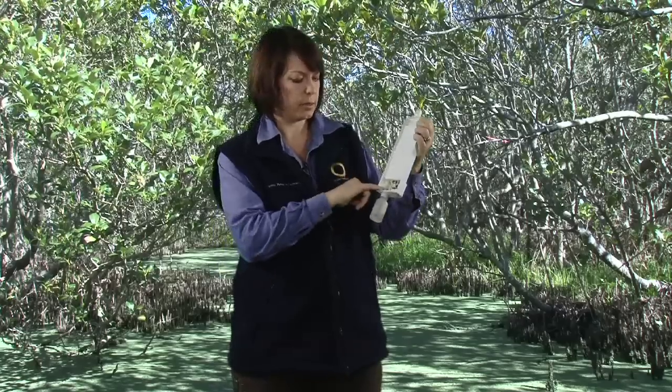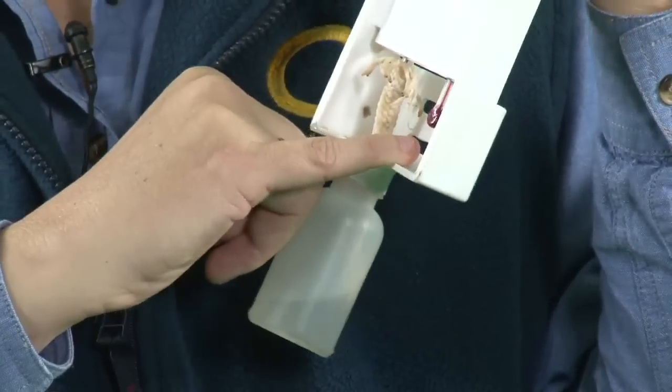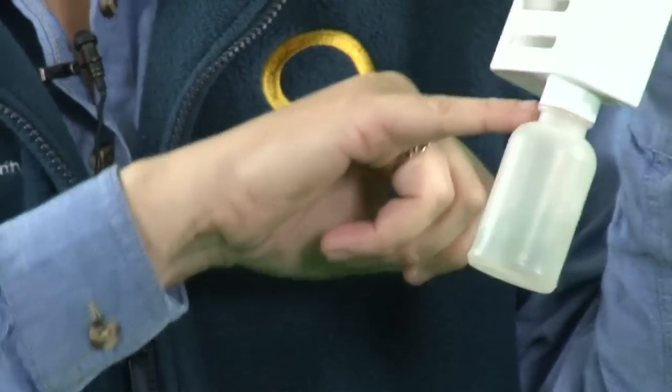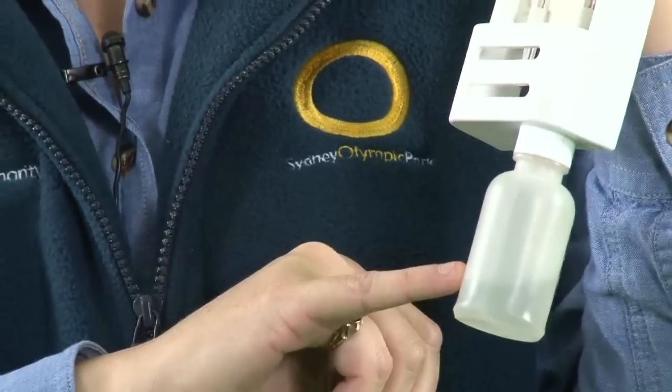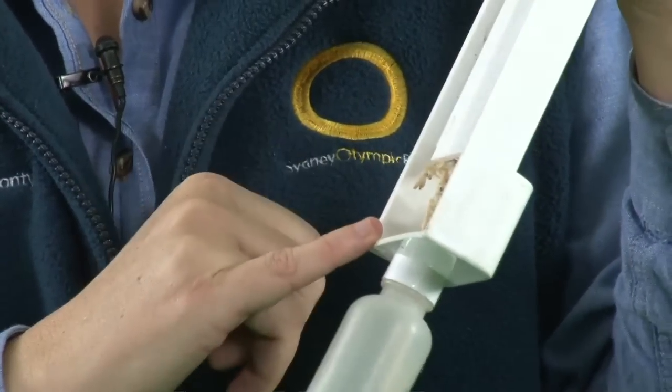The reason being is that we have a wet bulb and a dry bulb here. So the first thing we have to do is make sure that our wet bulb — the reservoir below our wet bulb — has some water in it, and that the wick coming up and surrounding that wet bulb is wet itself.